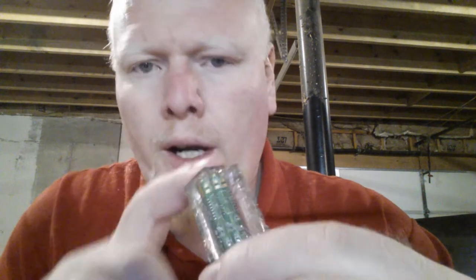So that's what we're going to be doing in this project. The first thing I want to do is square one end up. The challenge is to get this cut to the exact length of the brass tube for the particular pen kit — if it's too long or too short, the pen is not going to function properly. This blank is a little different: the tube is already inside it, so you just have to cut it to the right length. We'll start by squaring up one end, use that as our reference point, cut the other end, get it all squared up, and then we'll be ready to take it to the lathe.